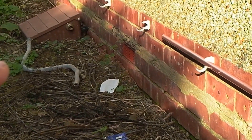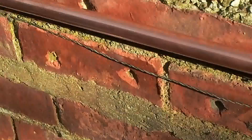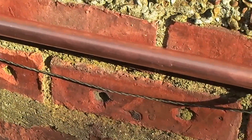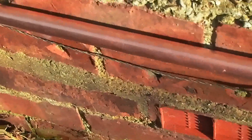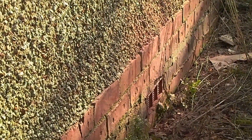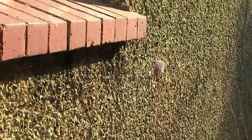That way it will come straight out of the metre — there will be two bends and there won't be any joins in that. It will come along here, there will be a join about this point, and then another pipe that will go along and then up into the pipe through the wall there. I'm hoping we'll only have perhaps one soldered joint on the outside. At that end I'm hoping to be able to bend the pipe through 90 degrees and then another 90 and straight through the wall, so again there are no joins there.